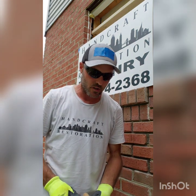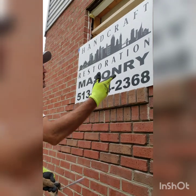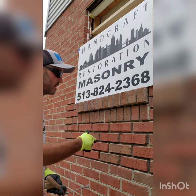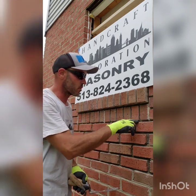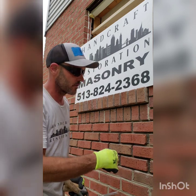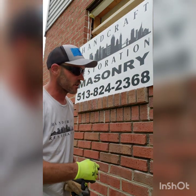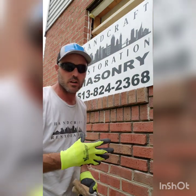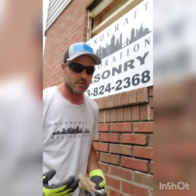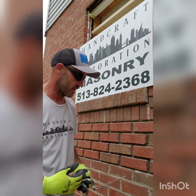A few things we're going to need — I've got my mortar mixed up. I've laid this window sill; it was a large window and they wanted to make it smaller. So I came in and laid this up. I always like to dig the mortar back on projects like this when I lay them, because I was directly in the sun all day, it's about 90 degrees outside, and these bricks are such dry nature that it's just sucking the water right out of the mortar, making it a pain to joint as you're going when you're in direct sunlight.